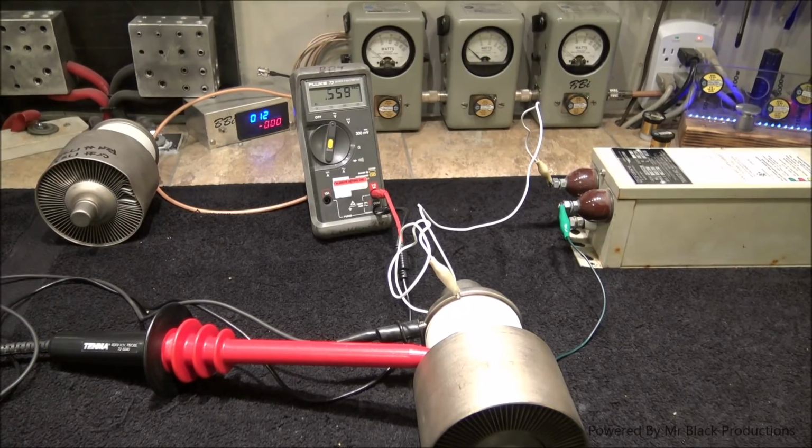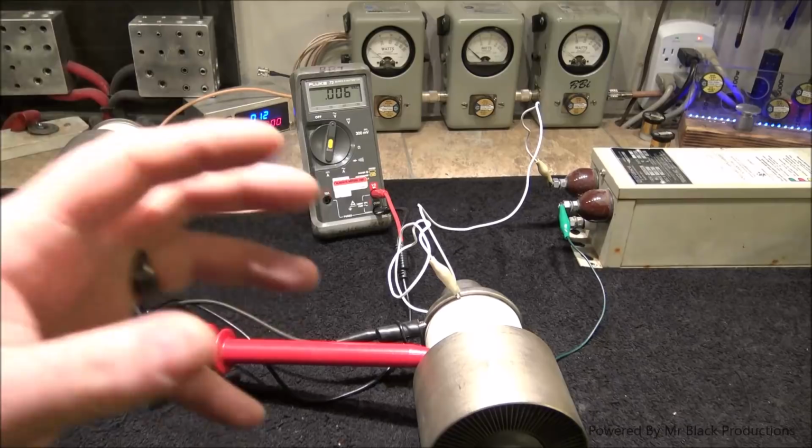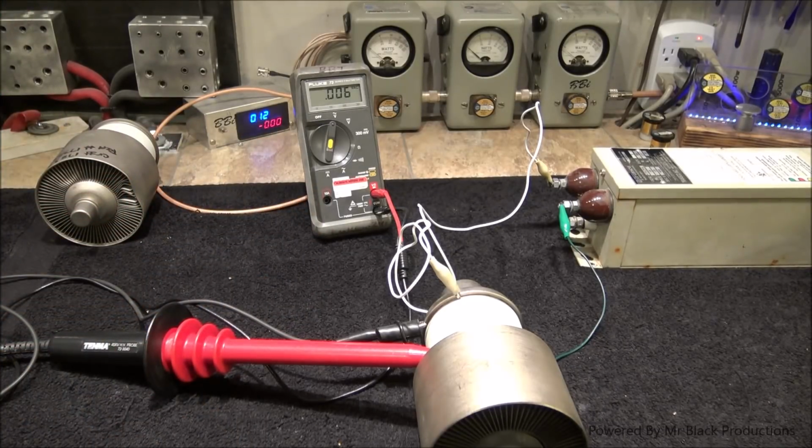So my friend, without breaking a single thing and with no arcing and no sparking, I can say definitively to you, bro, this tube needs to be rebuilt. So, on that note, we're done. Guys, I appreciate you tuning in. This is just very basic. And please, everybody, don't freak out too awful hard over this video. We're just doing a very basic test. We're using very small amounts of energy to prove to ourselves that internally there's something wrong with this tube, and then it needs to go off to somebody way smarter than me, and that head needs to be cut off, that insulator needs to be cut off, the screen needs to be rebuilt, and grid needs to be rebuilt. This tube has reached the end of its life, unfortunately.